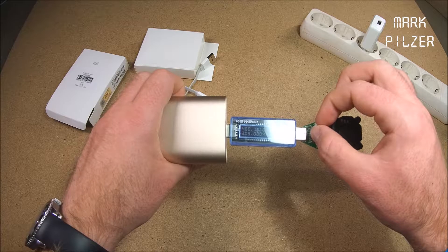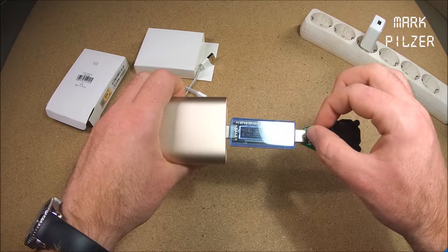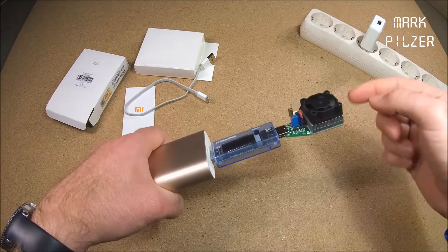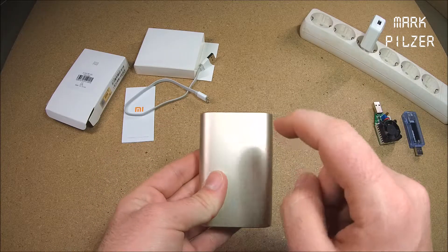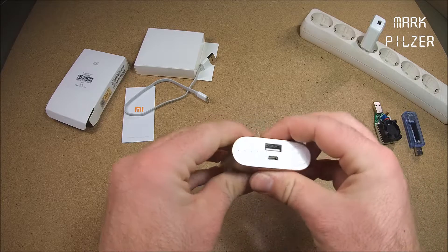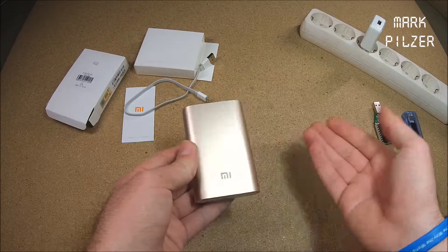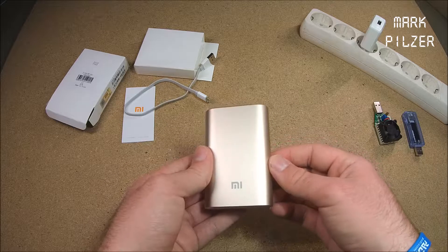And we have 1.2A drawing — so it seems to handle over an amp. What I should clarify about the cable is: when using it with the power bank to charge the power bank itself I haven't had any issues. When using it to charge batteries, for example with the Li 202, I get issues. Maybe there's too much resistance because the cable is very thin. But let's put the cable aside as we don't need it anymore right now.